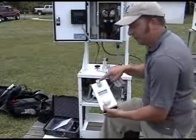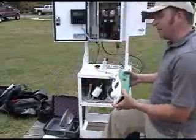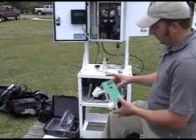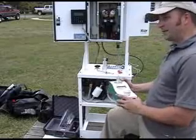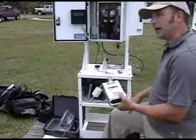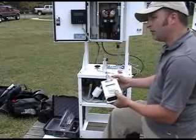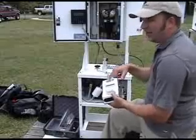You also have three different tubing adapters depending on the size tubing you want to use. It runs on batteries and/or AC power. It has a barometric pressure reference and temperature sensor. This can be upgraded to have an external temperature port. There's also software — you can hook this up to a laptop and monitor flows over long periods of time, logging data. It gives you barometric pressure in millimeters of mercury and millibar, temperature in degrees Celsius, and both volumetric and standard flow — QA and QS respectively.